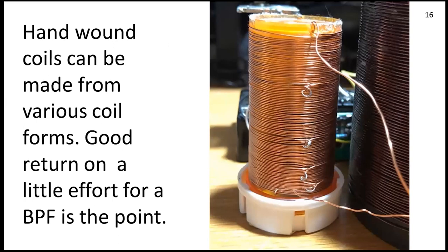That problem stopped when I soldered two diodes back-to-back across the dongle input — any static wouldn't haunt the program that way. The diode capacitance may attenuate a few microwave signals if that's somebody's concern, but not HF. There's nothing like putting a couple of diodes across anything if it didn't require power.